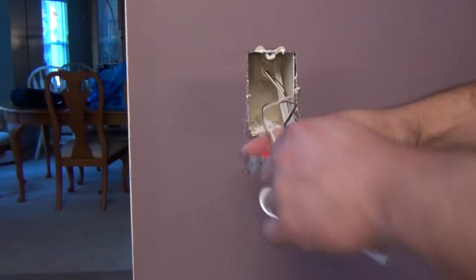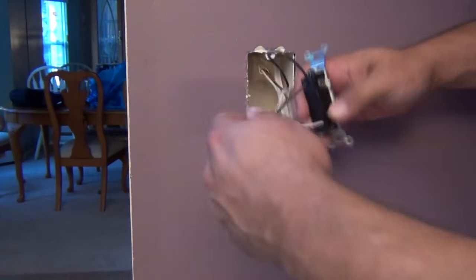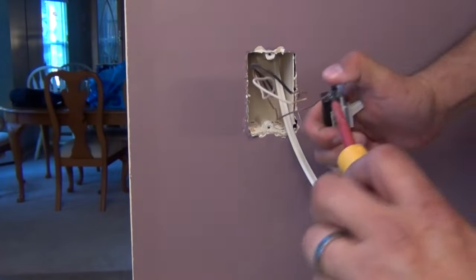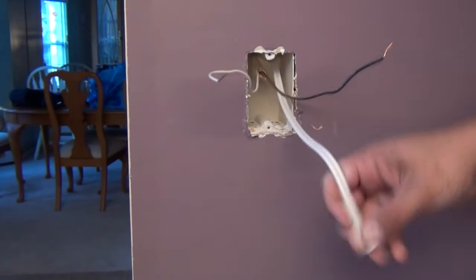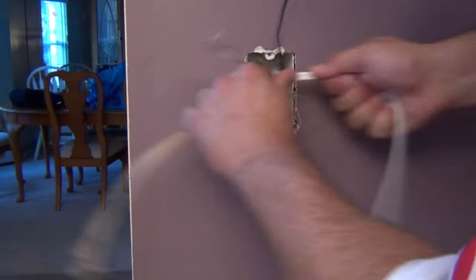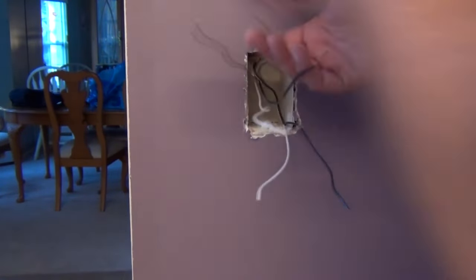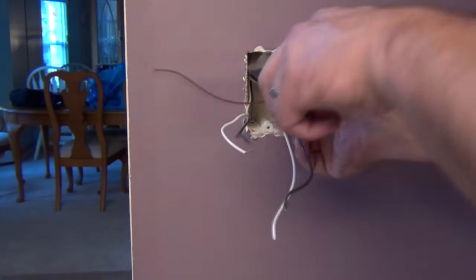Up at the switch now, we're going to start preparing this for the rewire. Ripping off some tape on the switch, checking the power to make sure it's off — the switch was hooked up with stab-in connectors as well, so I'm using the screwdriver to remove the two wires and then remove the screw and take the ground wire off. That white wire you see coming into the box with the Romex insulation still on it is the wire going up the wall to the new light, so I'm going to strip that back now. The original black and white on the top of the box are the wires coming from the outlet we just rewired.